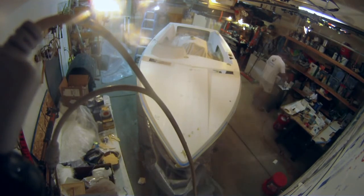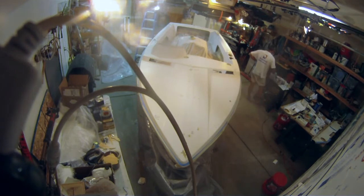Wrapped the mohair roller in painter's tape and tore it off to clear that of any extra debris. Then I added 8 milliliters of the top coat reducer, stirring thoroughly. I poured small amounts of the mixed paint into the tray so the full batch could stay covered to prevent evaporation of the reducer. I did my best to move the roller slow and work in small 2 to 4 foot sections depending on the width.